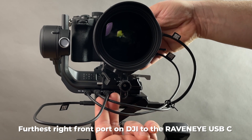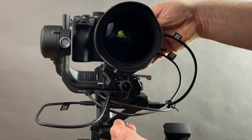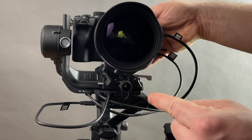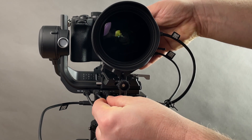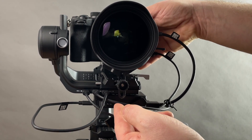I had these two wrong — the three connections on the DJI were switched. When that happens and you try active track, you can select objects but the camera won't follow. It's because these two connections are so important to be in the right spot on the DJI RSC2.